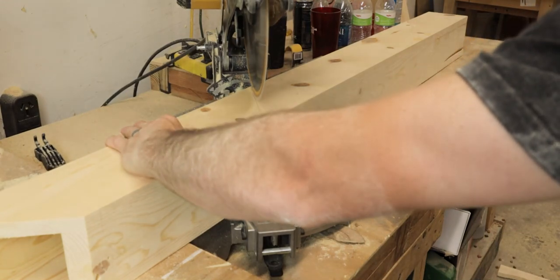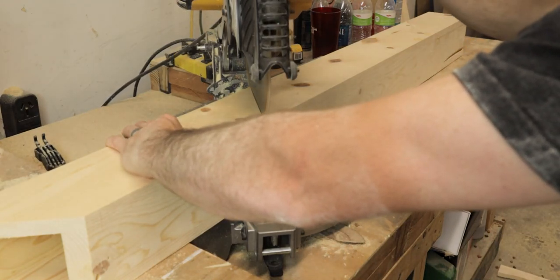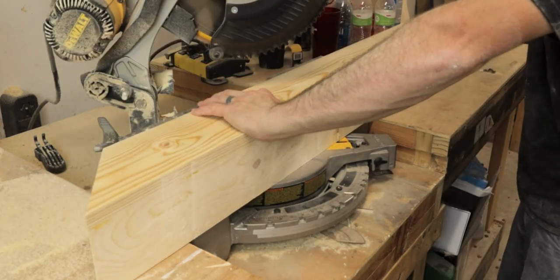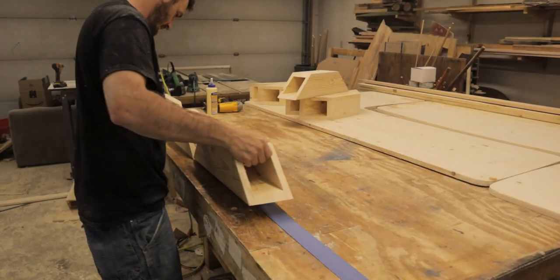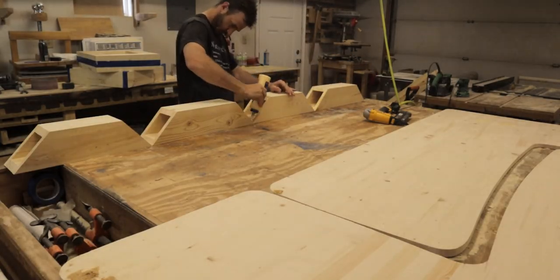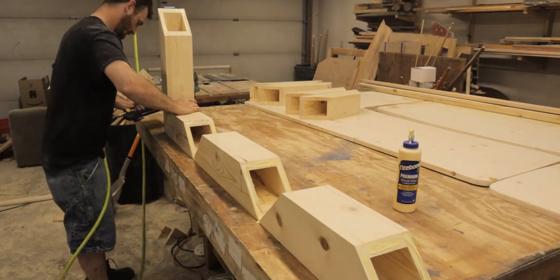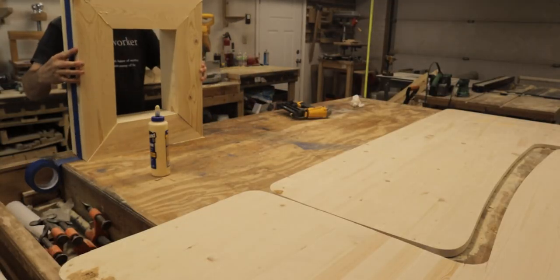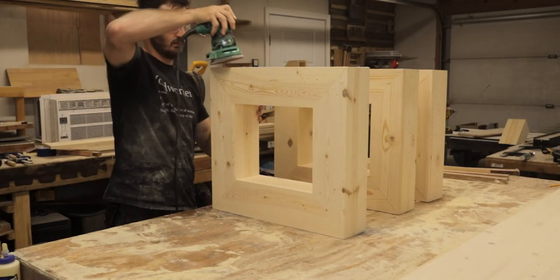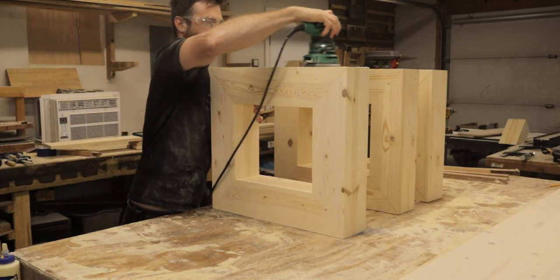The legs were really easy to make. They all needed to be cut to 45 degrees and there were only two sizes that I needed since these are really just rectangular legs. I laid all of the pieces on a piece of tape so they could be held together and then I put glue on each of the joints. Then I could just fold them together putting the brad nails in each of the joints. The nails are only there to hold everything together until the glue dries. Everything got a quick sanding up to 300 grit before going on to the next step.